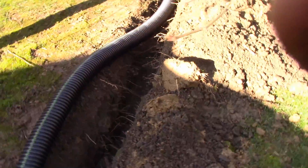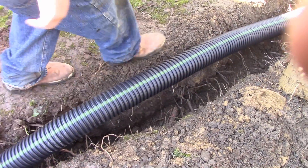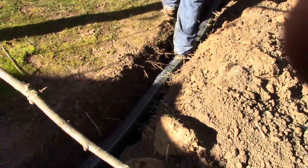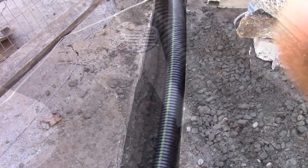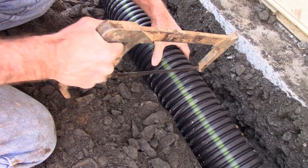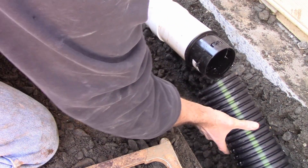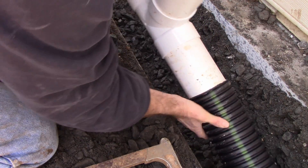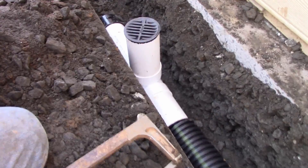Pull it tight — make sure it gets down to the bottom, past those roots. We just step it down into the trench because there are lots of tree roots that tend to make it pop up. Make sure you get past your roots. Now we're ready to cut this off to length and hook up the drain. Lay it over the top of your fitting and cut it off. Then you can lift up the pipe and do whatever you want — remember, these are barbs that just snap together. Lay it back in the trench. Next, we'll go ahead and hook up the next section going all the way over to our catch basins and the gravel perforated pipe.